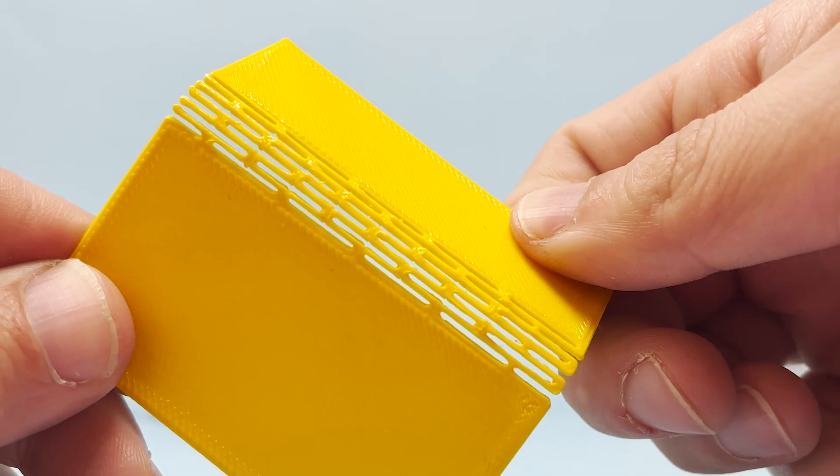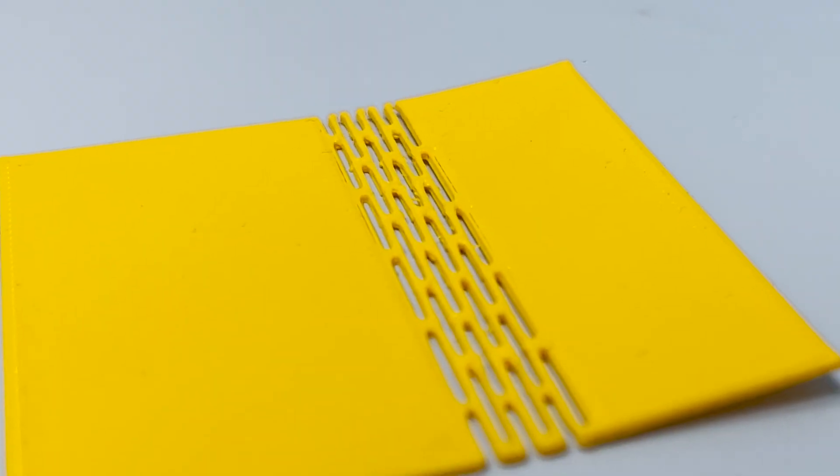This is a pattern of basically having a piece of material connected in the center and then two edges that bend. That gives you a lot of freedom — it can bend pretty well. But you have to design this around the radius that you're trying to bend around. This hinge type is fairly easy to manufacture, though it's not ideal because of the precision required. But it can be made very chunky.